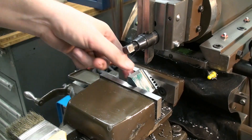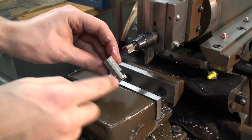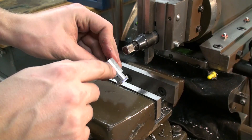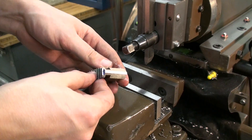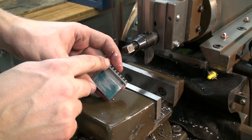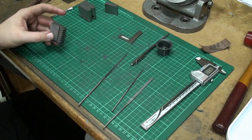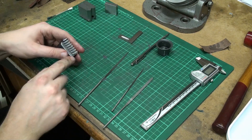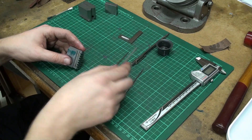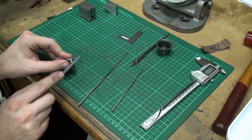This was the last cut on the third of the jaws. That means we have done all the bevels on all the jaws, and now I'm going to deburr the teeth and the slots. Deburring is a matter of handwork — I'm going to use my needle files and just break the edges on these teeth.